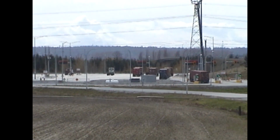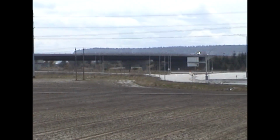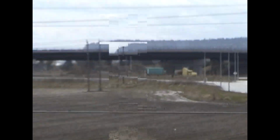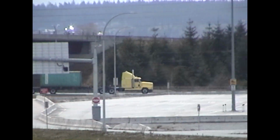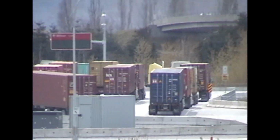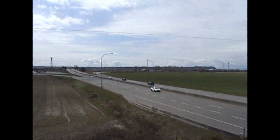Okay, got a bit of tape damage here. There's a crease in the tape. You're seeing it. That's a crease going around the head drum. This tape got chewed up once. That's digital dropouts, as they're known. That would have been lines of snow going from the top to the bottom on analog. And it's got a pretty fast zoom out as well.